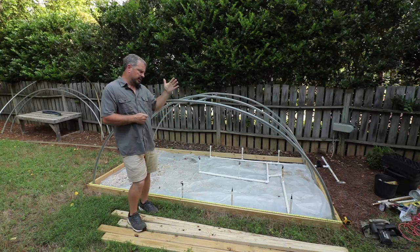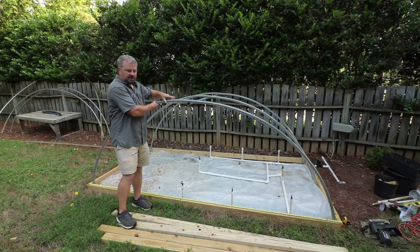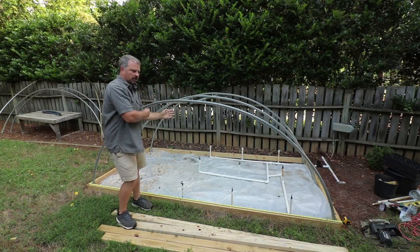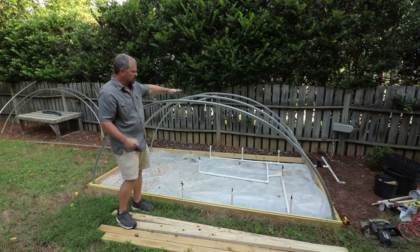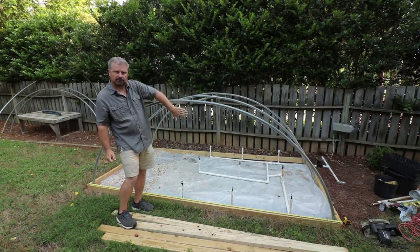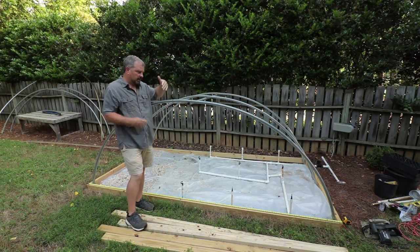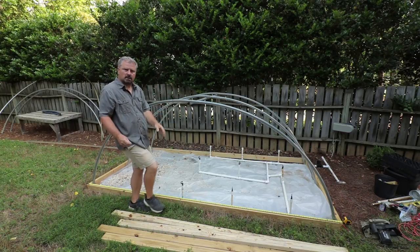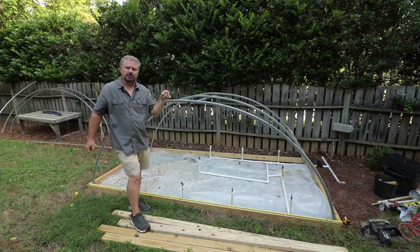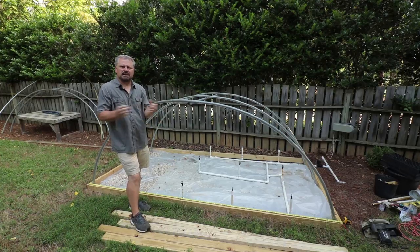In this episode I'm going to build the end walls on both ends. First of all it makes the structure more rigid, and it creates doors — there's one on that side over there. I don't really need a door but it created one on this side for me. It also creates a place for the plastic to wrap around the frame and be stapled to the end wall to keep the plastic tight. I still need to bolt these hoops down to the frame, so I've got to drill holes through the wood and through the metal and get those bolts in so this doesn't fly away.